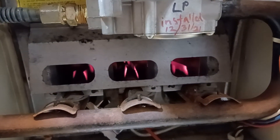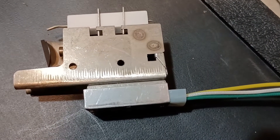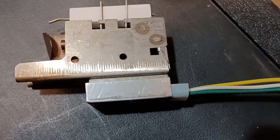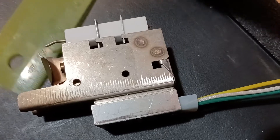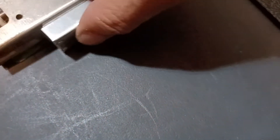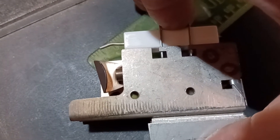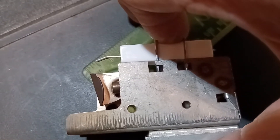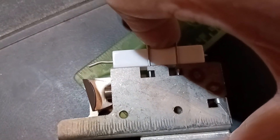So that's it. I'm going to turn it off and adjust the gap and show you what I mean. Here's the pilot assembly with the right gap. It should be about one-fourth of an inch — if you have a ruler — from the edge of that sheet metal and the tip of the igniter. Just try to measure it to get the exact gap there.